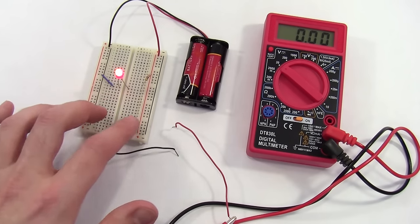Stepping down to 20 milliamps, I get an extra decimal place — about 12.21 milliamps. Going all the way down to 2000 microamps, I've gone too low. So going back up to about 20 milliamps gives me the most accurate reading I can get for this circuit, with two decimal places.